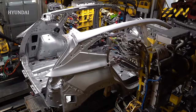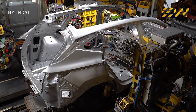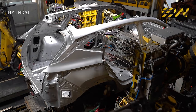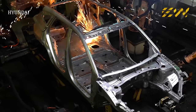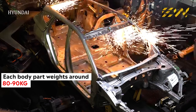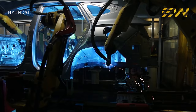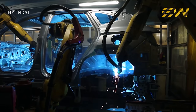The manufacturing process to make the shell of the car begins with the floor pan, which moves on the conveyor belt while all the other parts are welded one by one, and the shell body slowly comes to life. These robots with huge articulating arms can place the body parts, each weighing around 80 to 90 kilograms, and weld them with great precision and accuracy. These operations are done at a very high speed with minimal errors.